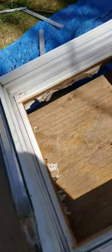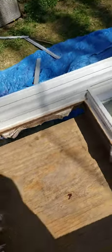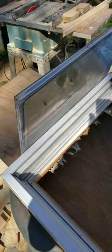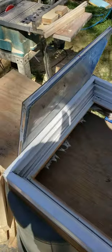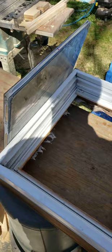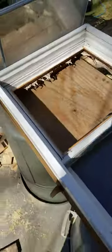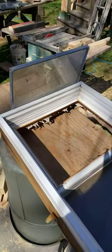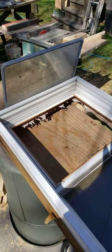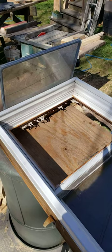It's 5/8 thick, and I don't think you can get it from Andersen, but you can get it from any online glass shop. They'll deliver to your house for maybe $100 a piece of glass. The whole sash from Andersen is probably $200, and of course you're going to have to wait months to get it. So good luck!